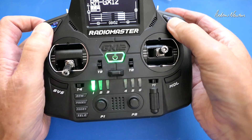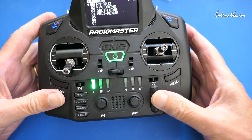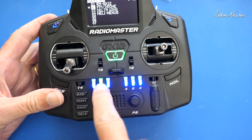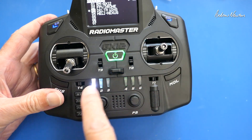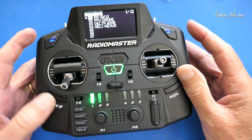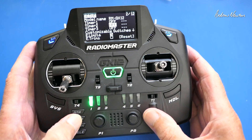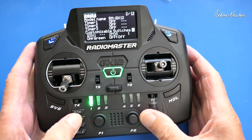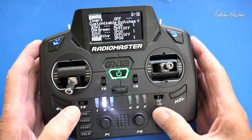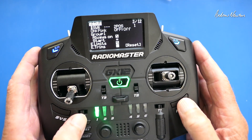The switches down here have colour lights in them and can all be programmed to whatever you want. Choosing a different model — with this one we have blue in the off position and different colours in the on position. For a delta wing model, just white comes on when you hit that switch. The switch colours up top you can set up in the available Lua scripts. Setting up these switches is on a per-model basis — go to the customisable switches section and you've got switch 1, switch 2, all of them. Change the action, change the colours — very, very configurable.